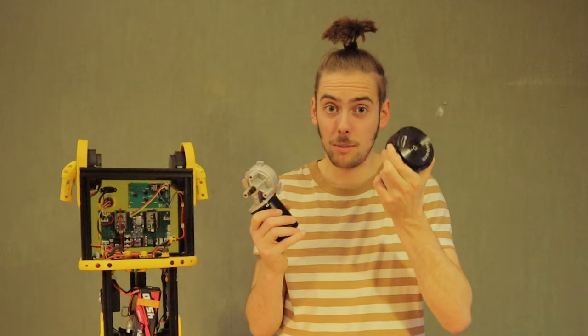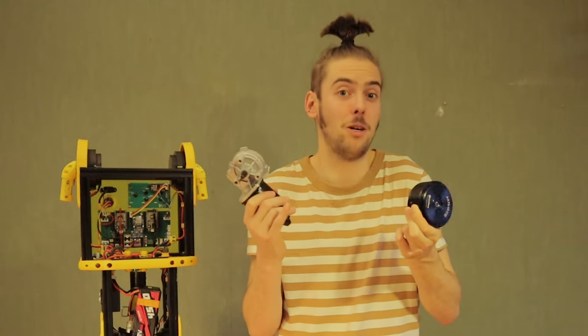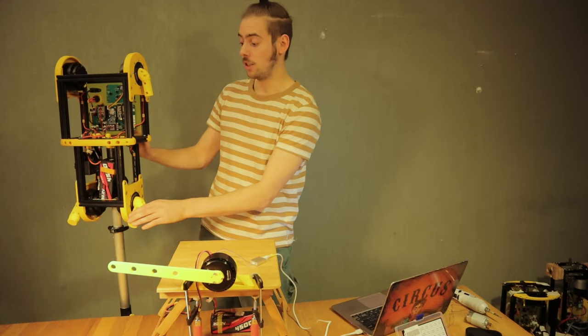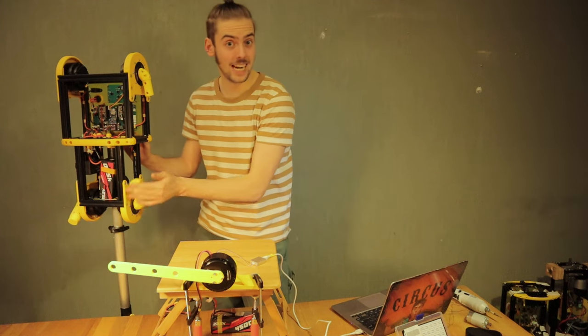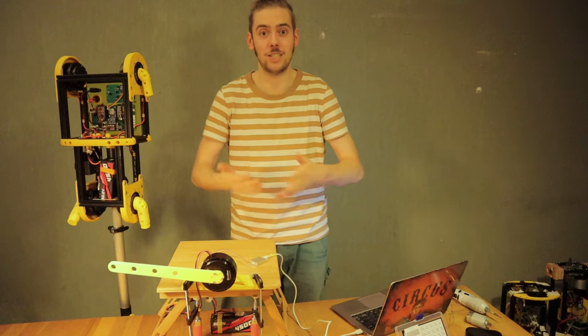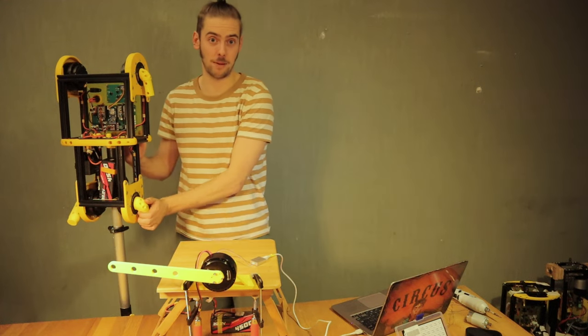The performance of the motor module is still better though — it spins about four times faster than the wiper motor does, so that can be useful sometimes. But for me the biggest difference is that these planetary gearboxes are back-drivable, meaning I can safely rotate the motor by hand. This also has a side effect that you can measure the amount of torque being applied on the motor.